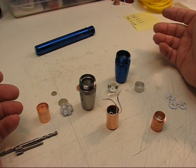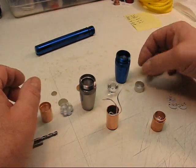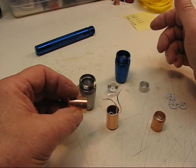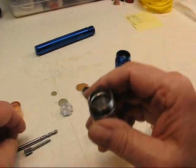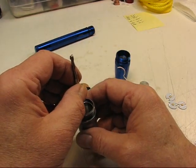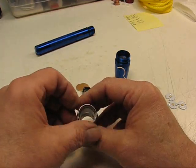The old heat sinks were copper shot and solder inside a copper housing. The new ones, I've just gone to aluminum. I've decided to do some boring of the heads, which I haven't been doing. I've gone with the half-inch copper pipe couplings, which I have to bore the head. So what I do now that I'm using the drill press is I take an end mill bit, put it in the drill press, and then go to the proper depth I need to, and then I just hold the head and turn the head while the drill press is running to scrape aluminum out of the head. That's about the best way I can come up with it.